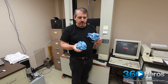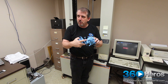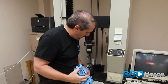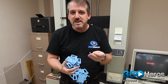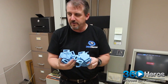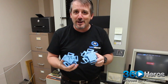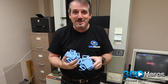So the final result: after taking two of the H3 Pro 7 holders, we have actually torn both of them apart in both cases. As you can see, they broke in a variety of different places — whether on the arm, the side piece, or elsewhere. But in all cases, everything broke at over 70 to 80 pounds. That gives us quite a bit of pull across each of the different tests we did today. I'd like to thank Keystone Tool and Die for all their help today, and thank Matt for all of his help. Hopefully we can get this online quickly and everybody will be able to see how the 360 holders hold up under extreme pressure. Thanks, have a great day.